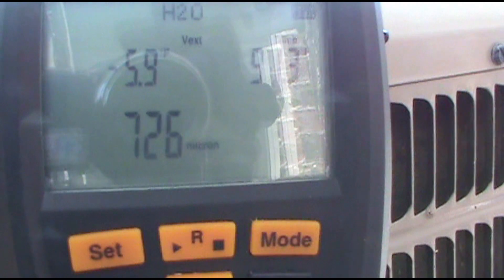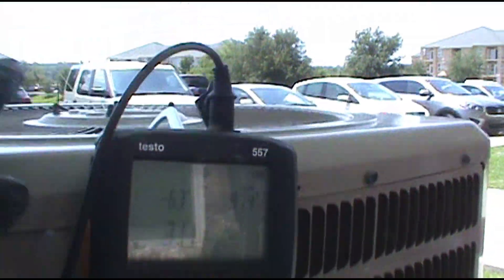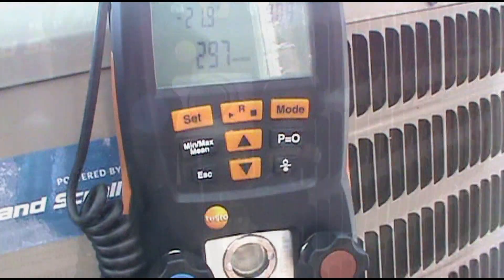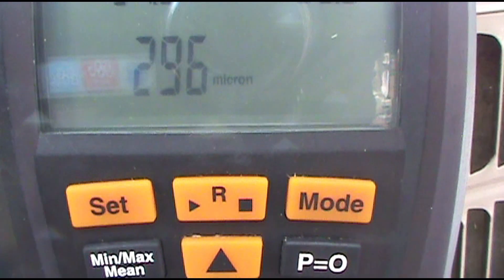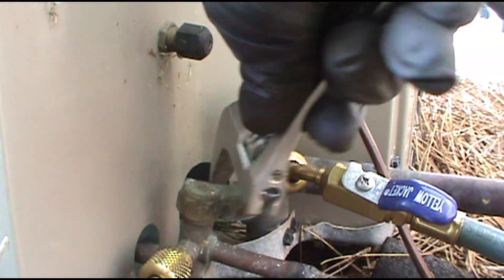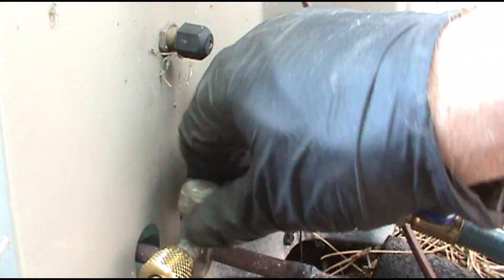Pulling it back - I want to go to 300 microns. We're almost there. I put my micron gauge right here where the yellow hose usually goes. It works for me. I've got some out here that I did years ago exactly like this that are still going strong. All right Skid, we are below 300 microns - nice deep vacuum. I always put the caps on when I pull a vacuum just so it pulls a nice vacuum.